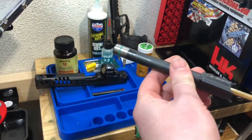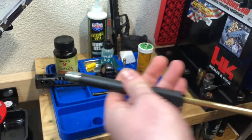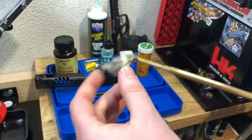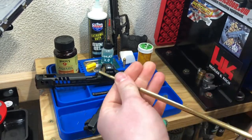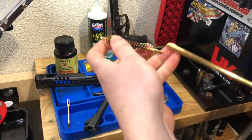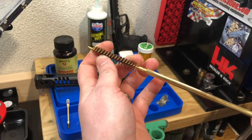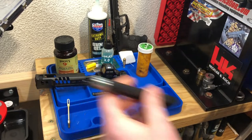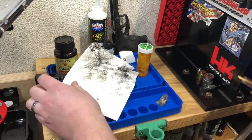It sat for about two or three hours. We're going to run that same patch down the bore a couple times - there is some carbon on it, you can see how it's a little bit dark there. Now we're going to go over to the copper brush. If you're doing precision rifle, maybe a copper brush is best - on pistol I've never found it harms anything and it definitely helps to get that carbon out.